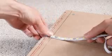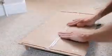Now it's time to add the LEDs to the panel. Cut your strips of LEDs into 50cm lengths — always make sure that you cut between the copper pads, which are between every three LEDs. Once you're done you should have 30 individual strips. In order to solder wires to the strips, you'll need to bend back and cut off the waterproofing material from each end, leaving the solder points exposed. Now they're ready to stick to the panel, but first draw a horizontal dividing line on the front panel to help you keep things straight. Peel off the tape cover on the back, stick the first strip just to one side of this line, then do the same with the next strip but offset it so that the LEDs start to make a checkerboard pattern. Continue this process until you've stuck on all your strips.